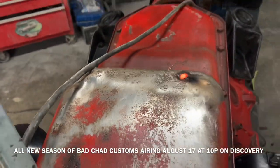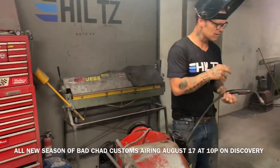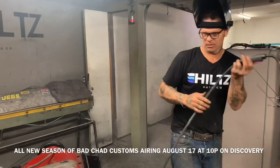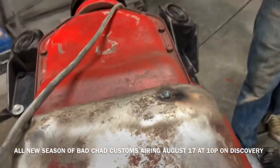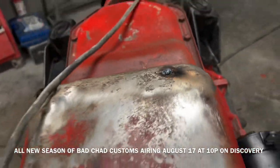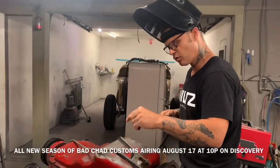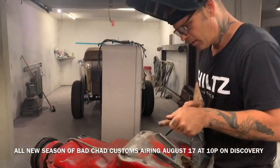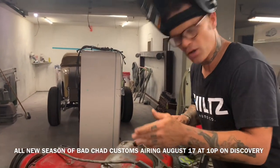All that does is give me enough material that I don't burn down through — that's all that does. I'm grabbing some material from this so it does not burn down through. I'm going to do a little more weld around the edge there because I see a little pinhole, but I'm not going to gather it up too much anymore, just weld around it now. I've got the meat there. Now I can use that meat to weld that up and then I'll just grind it off — not flush, just enough that I know it's welded.